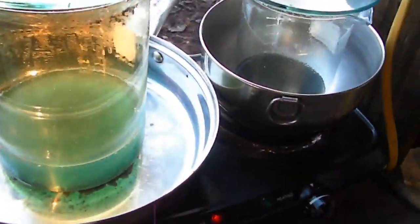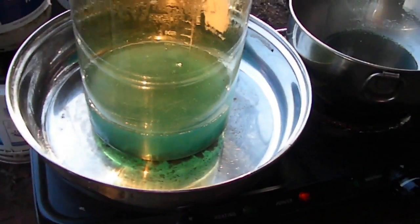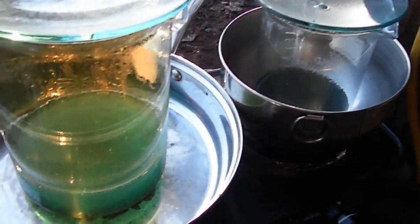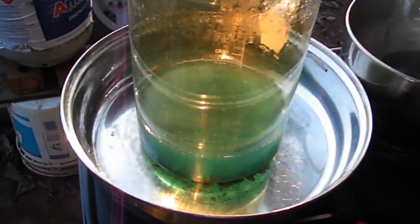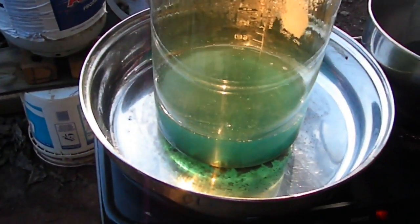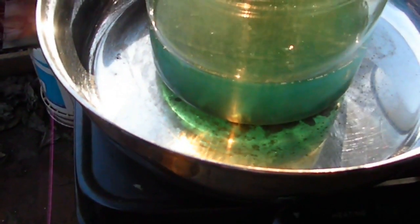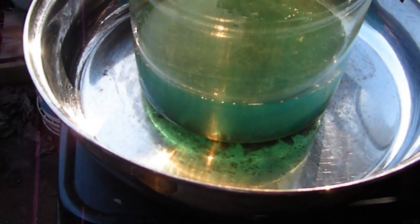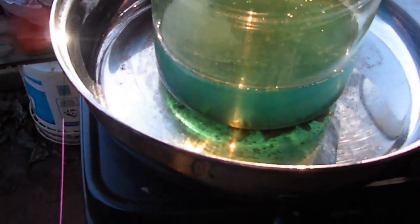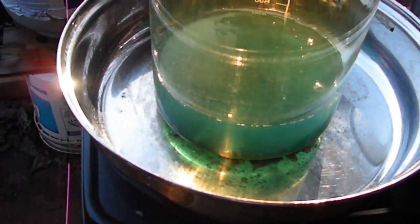Okay guys, it has been about another hour, and our reactions have slowed down quite a bit. I actually just swirled them up. One thing about the tungstens, and I probably have never said it before, but when you're doing contacts and they're tungsten, there's a little powder that always comes off of them. I'm assuming it's just some of the tungsten, but it will lay down on top of those contacts, and it'll make it take a hell of a lot longer for it to dissolve, or it'll sometimes even slow the dissolve completely. These weren't doing anything when I came out here, or barely doing anything, and now you can see just by swirling that up and getting that powder off of the contacts, granted it goes into the solution and it'll settle back down on them again, but you keep dissolving stuff more and more. So I am going to put just a touch more nitric in these, and I'm going to just continue to let them go. So we'll check them again in about another hour.